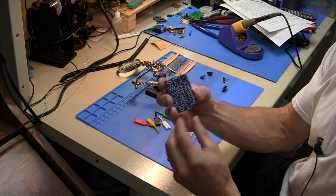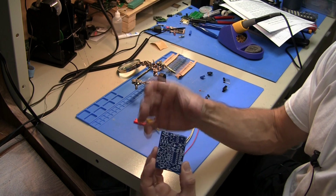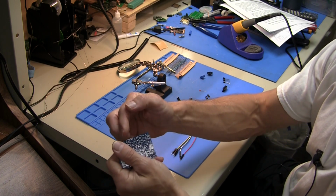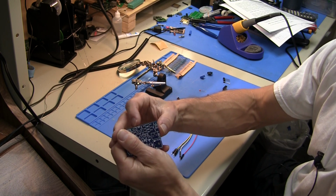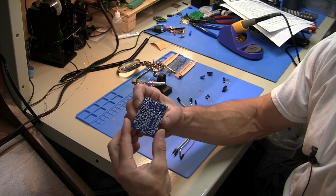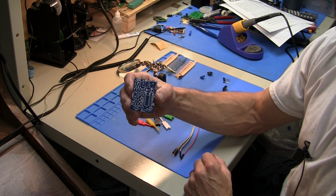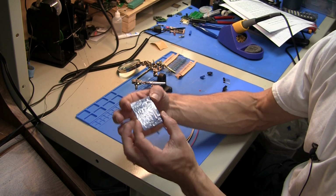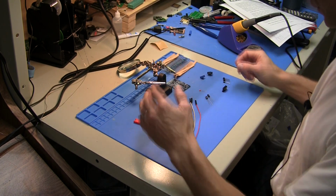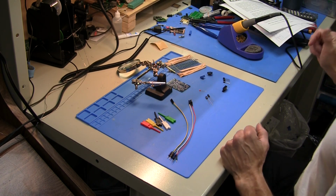Okay, this should be mostly all that I need for this composite mod. The Mark Data board was a small board. It was actually larger than this one that I've recreated, but it was a small, simple board, and it mainly used some of these components sort of to the right of my board. And I've added some circuits that will allow this to be a more complete mod in case I want to actually remove the RF modulator from the Coco 2, assuming this works. I'll remove the RF modulator, and this will hopefully fit down into the spot where the modulator was occupied before. Okay, so with a few test clips, a few capacitors and resistors, I should have about everything that I need here. So let's get this started.